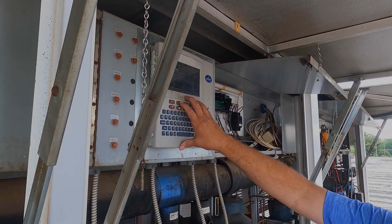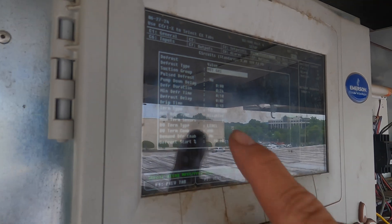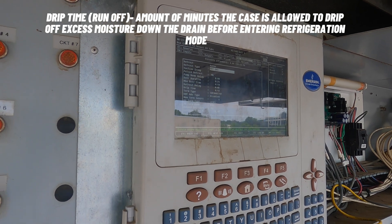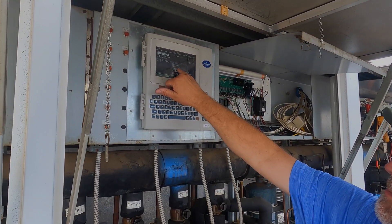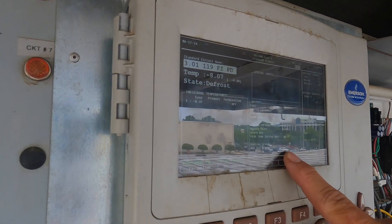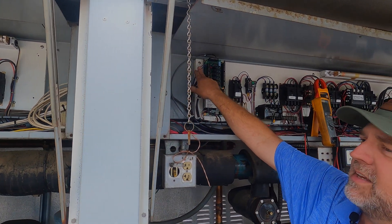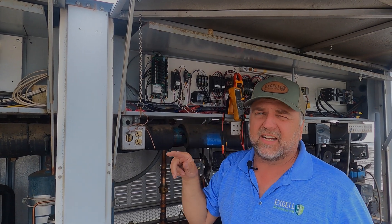As you can see in our setup, it's programmed to allow defrost for 24 minutes maximum, followed by a 13-minute runoff — after defrost it sits 13 minutes so all that liquid water drains out of the case so we don't ice up a drain pan. Our state is now defrost and our EEPR valve is closing off. We'll give it a moment to close off and then you'll see it go active — right now we're inactive. On this board here is what we call the master gas valve; when it energizes, it energizes a defrost differential regulator to allow a differential on our defrost.